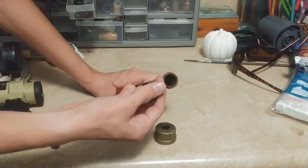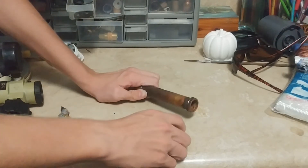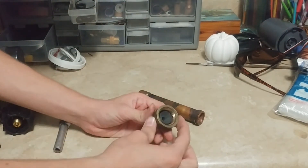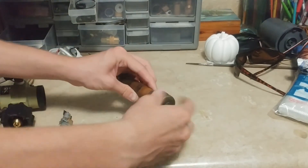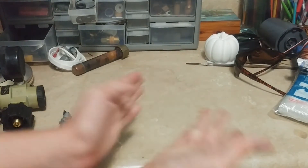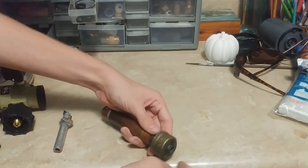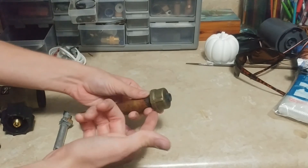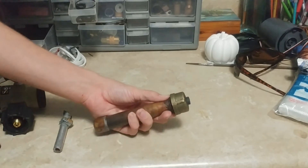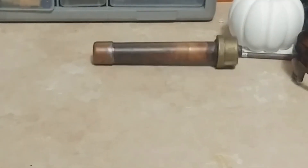And then with this nozzle, I will mold a little bit of fuel and flatten it out here. And then with this threaded cap, I'll put an o-ring there, set this nozzle in place, and then screw this so the two halves of the fuel are squished against each other. And probably put some RTV silicone there to make it real nice and sealed. And then it will press against the o-ring as I tighten it, making it even more sealed and everything will stay in place — a lot more secure than just four small screws. So yep, there's the new design.